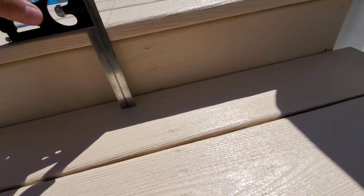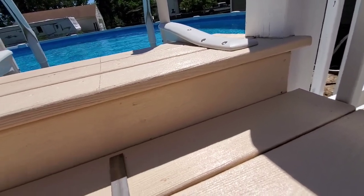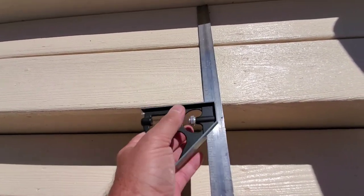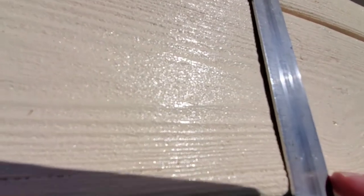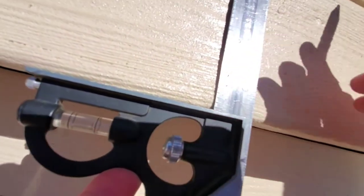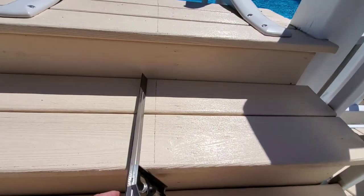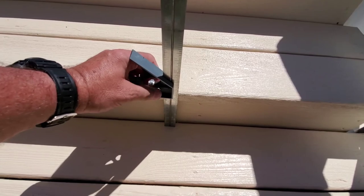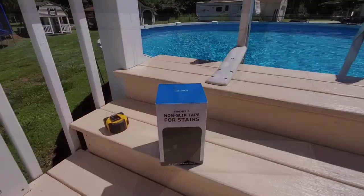You see that? Then we'll take our tri-square — I'm gonna tighten up on that knob and make sure I'm flush against that wood. There's our other center mark, and we'll just continue down and transfer our mark. There we go — we got all the marks down and transferred to our center mark, all the way up.